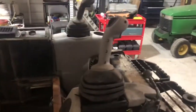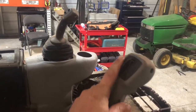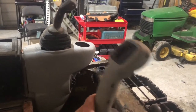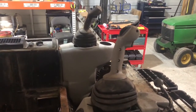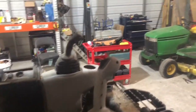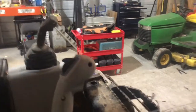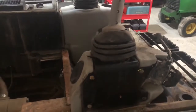It didn't quit working, but there was something not right with it — you had to fiddle with it to get it to work and it didn't return to neutral. So I wanted to replace just that button. Caterpillar does not sell that button. I tried to look up a bunch of numbers on it, and Caterpillar only sells you this entire grip handle with this button, this button, this whole thing, the stud, and this rubber boot. So I got that pulled apart.